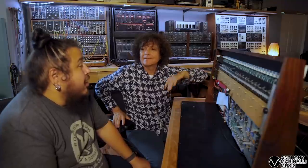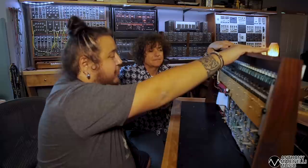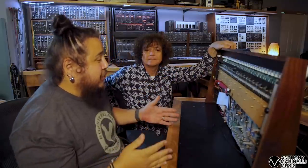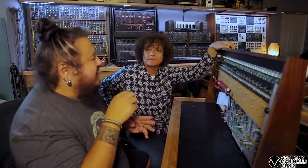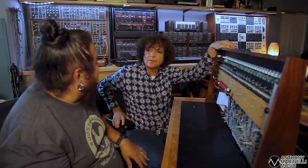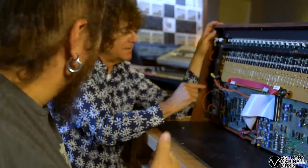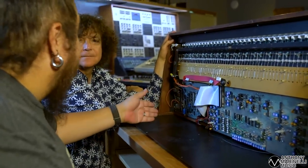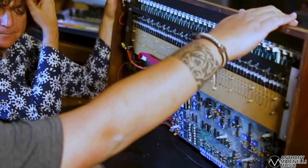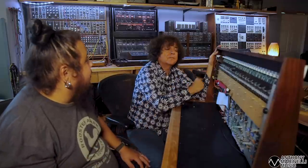It goes so much deeper than that - it'll say okay, you hit middle C and I need to send that to voice number one. And also, because I can auto-tune myself, if you're sending middle C to voice four, we need to add 0.014 volts onto that so that it's in tune. It'll fix it - it goes through a whole table of that internally. It'll store the offsets that it reads in RAM. So it'll know: if you press that key and it's going to this specific voice, we need to add or subtract this much voltage for it to be in tune. So it's extremely innovative.